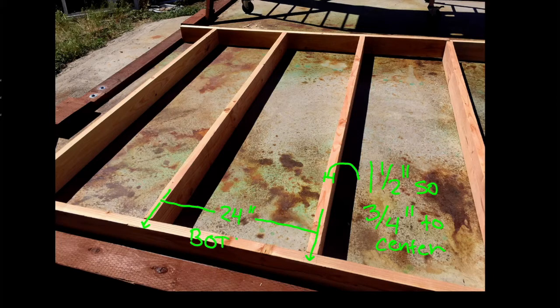Let's introduce some other terminology here. We have a bottom plate, that's the 2x6 that our walls are attaching to at the bottom. And then conversely, we'll also have a top plate. And in most cases on walls we'll build, we'll actually be building double top plates to attach multiple walls together. In addition, on this, we're going to have a treated mud sill or a treated board that our plate is attaching to, because remember, if we're attaching to concrete, we have a treated board. We're never putting untreated onto concrete.